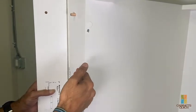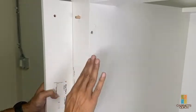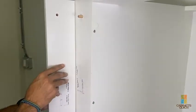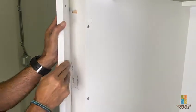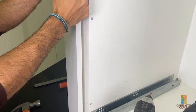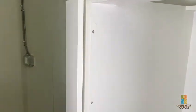The reason you leave an eighth-inch gap is because all the doors with the hinges or the drawer guides kick the door out an eighth of an inch. So the filler, in order to keep the plane of the door and the filler equal, you want to leave that eighth inch. We're going to align the holes with the dowels and then just push them together.